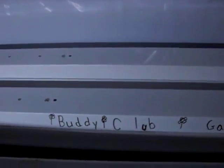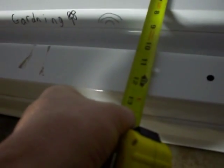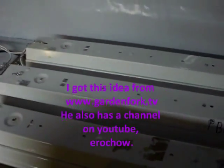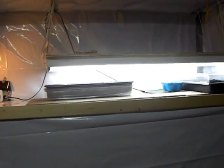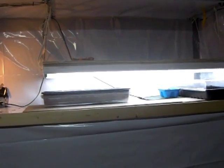I'm going to take all three of these shop lights and make them work as one unit. This piece of plywood is going to go on top of those — the lights will be flipped over and fastened to the plywood with some screws, making it one whole unit. I'm measuring across the top of these three lights, which is coming up at about 13 inches, so I'll go about 14 for the width. The length I'm making at four feet because we have a four-foot shop light. The lighting has been completed.